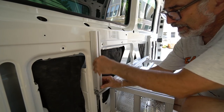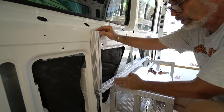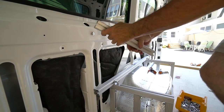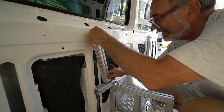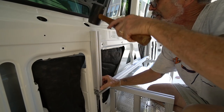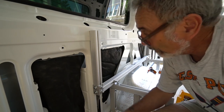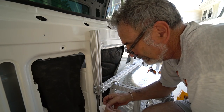Here's what we got to do — I need to put this piece right here. This is going to be a support for my kitchen module and it's also the end of the wall for the battery compartment. I started by putting a rivnut in the wall with a carriage bolt and turned it all the way in. When I get this on, it's tight. When I put this on and roll it back down, it's perfect — it locks it right in. I made this little sleeve plate and it's rock solid now. My kitchen module comes in on top and this plate holds it against the wall and down pressure.